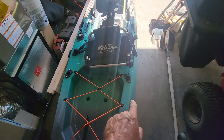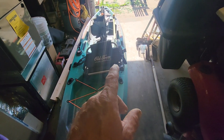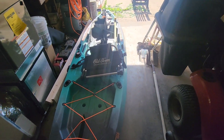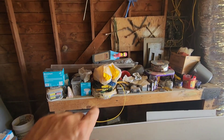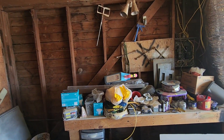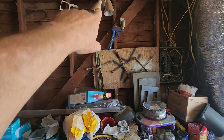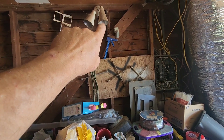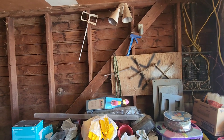From that same center point I'll decide where I want my strap in the back. I'm doing this because the board you mount the kit to needs to be, per the instructions, four or five inches longer than your measurement. I also need to measure from the wall to make sure when I raise the kayak up it doesn't hit the walls. I have a light over my workbench, so I need to keep the kayak far enough from that light so the heat doesn't warp it.